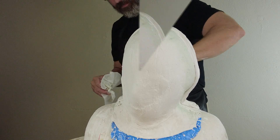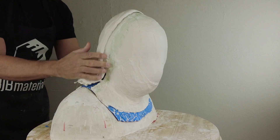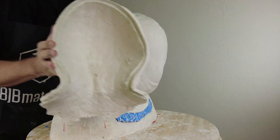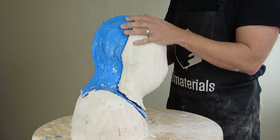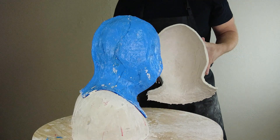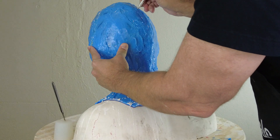After letting it sit for about 20 to 30 minutes, I'm ready to pop off the back half of the shell — and that came out nice and clean. You can see that little stair-step effect on the inside of the mold. Now pulling off the front half. Even though this doesn't have keys, you'll find the silicone seats very well back into the mold. You can put your hand inside the face and feel it go right back where it's supposed to go, provided you got that silicone nice and smooth on the final outer coat.